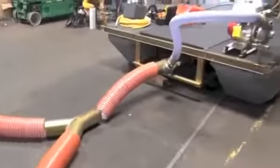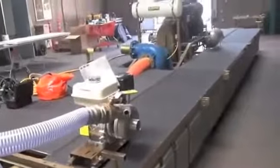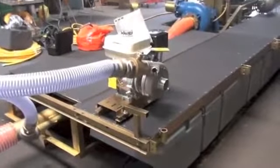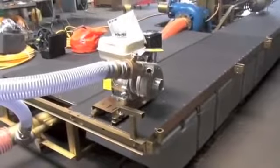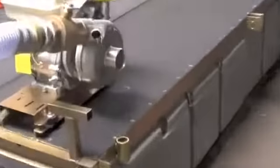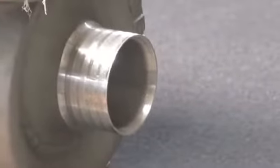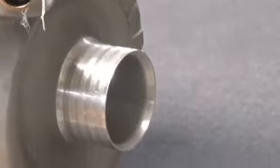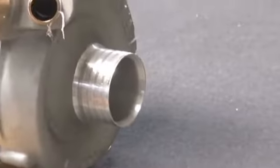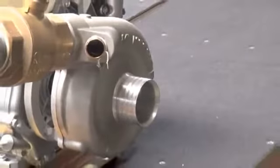You'll notice we've got this machine plumbed up. You've got a motor and pump here, and a motor and pump here. All this pump system is doing is it's used to prime the pump. So the way it works is you have the intake of the pump right there. Normally you would have a three-inch foot valve and hose assembly, and you prime that pump just by pumping the foot valve up and down until you see water coming at the discharge.